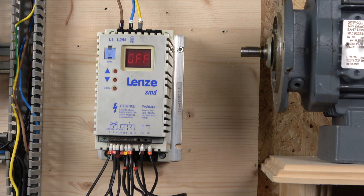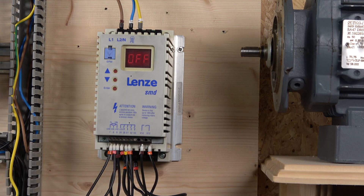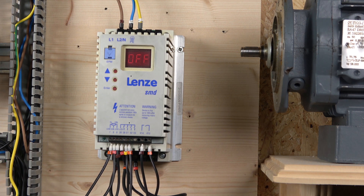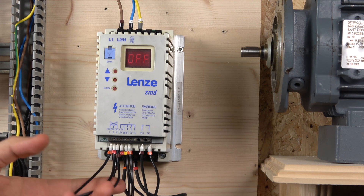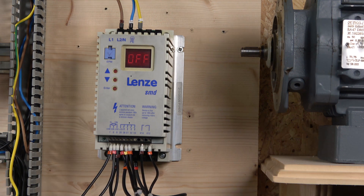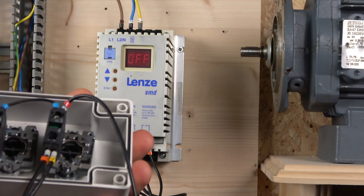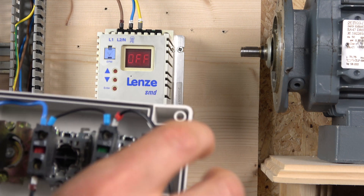One option is to use a relay outside the drive, but the drive has a built-in output relay we can use instead. The trade-off is you lose the deceleration ramp on stop — as soon as you press the stop button it opens the digital output, power no longer goes to digital input 28, and the drive stops. For wiring, we still have the potentiometer on terminals 7, 8, and 9. At the control station we have our e-stop, start button, and stop button.